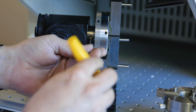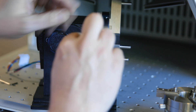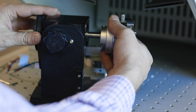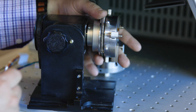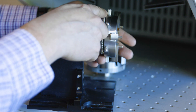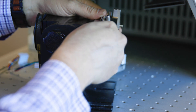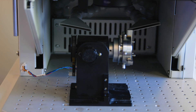Let's start by installing the rotary. We'll begin by attaching the ring accessory to the rotary attachment by unscrewing the two allen screws. Remove the fixture and place the ring accessory on. You can tell which rotary head is the ring attachment by the presence of the spring around the outside of the unit. Now we just need to tighten both of these allen wrench screws, then plug the rotary into the Galvo unit and turn on the system.